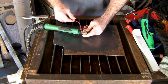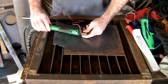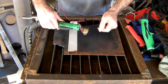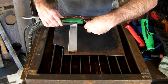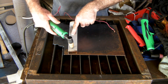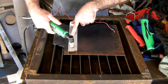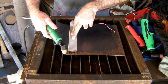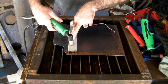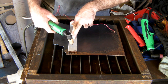This will get hot in a very short amount of time, so that's why I only use it to start when cutting really bad stuff. Here's an example — this is quite heavily painted steel. First of all I'll take the loop we made off the torch and try to cut it. See we're having not much luck at all — just pushing the button, not much happening. If you try and cut here, it's because it's heavily painted, and you'll get the same problem with rust. That's the advantage of a pilot arc torch.